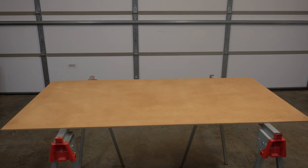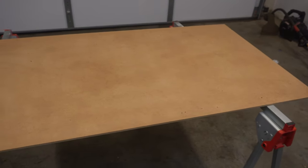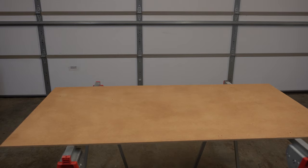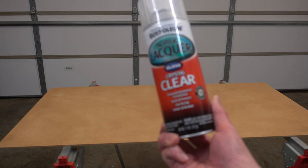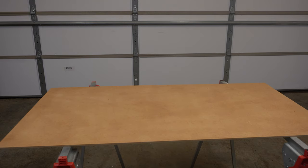Welcome to my garage — or as I like to call it, the not-really-a-workshop workshop. Any mess you see, please excuse it — I'm in the middle of a garage makeover and it's gross and rainy outside. This is the MDF board we're going to be using. I love using MDF for DIY projects: it's extremely smooth so no sanding is required, and it's extremely durable. However, MDF will absorb a ton of moisture, so since we're using water-based paints I decided to seal it first. I applied a coat, waited one hour, applied a second coat, waited 24 hours — that should seal it well. Now the first step is a coat of primer.